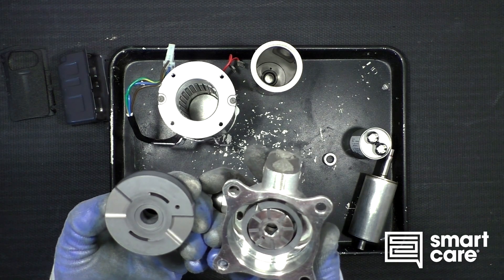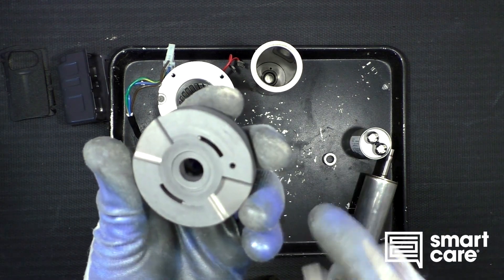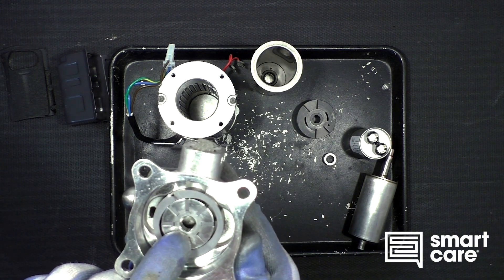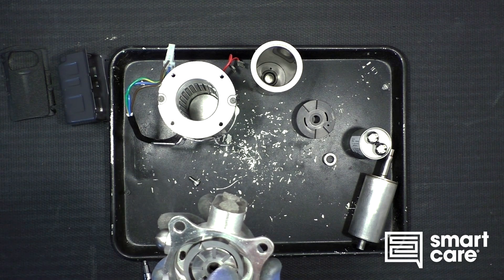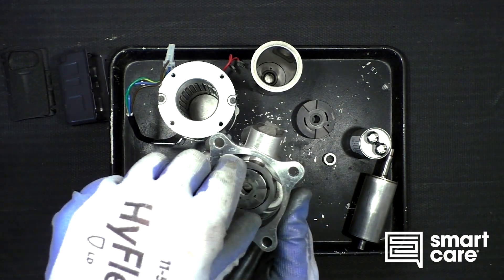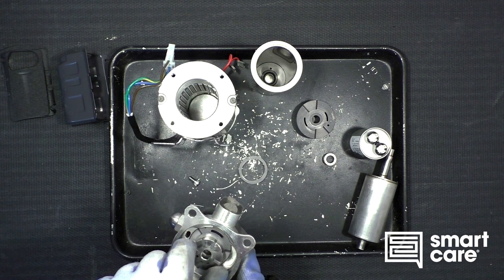If we pull that apart — oh look at that — it's a rotary vane pump. This is just a seal and it feels almost like a pressed graphite. You can see the material sort of powders up when I scrape at it. The actual pump itself is this rotating set of vanes. There will be some way to get some pressure behind the vane, and this is offset a little bit — it's eccentric. You can see in the housing there's a big end and a small end. Pulling that pin out, it looks like it's in there to keep this from rotating. So that's our eccentric housing, which is that same kind of pressed graphite material.